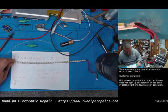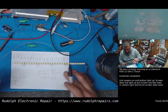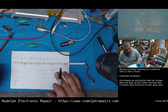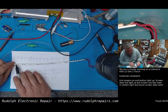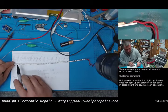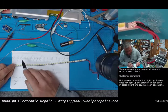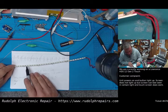So what I'm trying to do here is figure out how to distribute these shorted LEDs, in order to make no dead spots, to make everything the same illumination, I guess, once it's installed. So I decided to take out this first LED on the second strip, which is actually physically the second LED on this board. So based on what we did before, we have an off LED, an on LED, an on LED, an off LED. So it's off, on, off. So let's do that. So off, on, off.